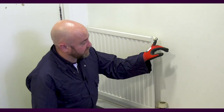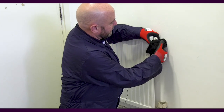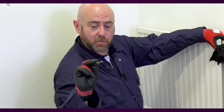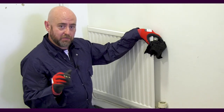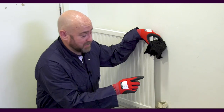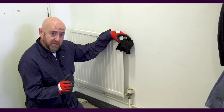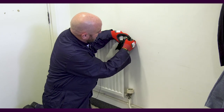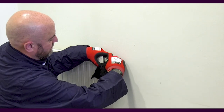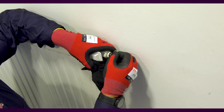Just be sure before you start — if you're not, get some advice first. In this case, our air vent is on the top right-hand side of the radiator. I'm going to place a rag just underneath that vent to catch any water when it comes out. I'm then going to use my bleed key — it's just got a square hole in the end which will go over the little pin. Be very careful: don't turn the pin too much. It's only got a very short thread, and if you turn it too much, the pin is going to come flying out, giving you uncontrolled water from the radiator — it could be exceptionally hot, and if you're on your own, you'll struggle to get it back in. So only open the valve just enough — just crack it open to allow the air to come out. Place the bleed key over the pin and turn anti-clockwise. Listen for the air. When the water comes out, turn it shut again.